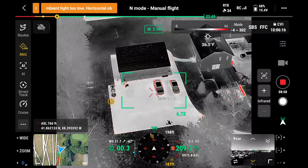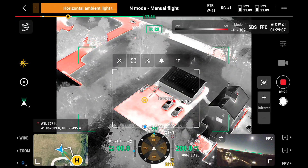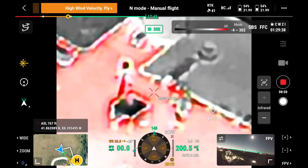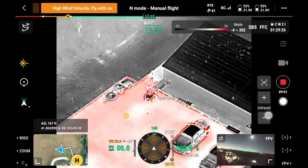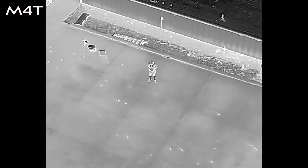Going back to the thermal camera, you've got the same functions on both drones. You can touch the screen and get the temperature for any pixel. You can do an isotherm where you draw a box on the screen and it will show you the hottest and coldest point within that box — really useful for many applications. You can zoom significantly with both thermal sensors, though the further you zoom in, the muddier it gets. You can still see a heat signature, but you may not be able to tell if it's an animal or a person. You also have over a dozen palettes to choose from. A lot of police departments and public safety agencies like to use black hot or white hot, as it's the easiest way to spot a heat signature.